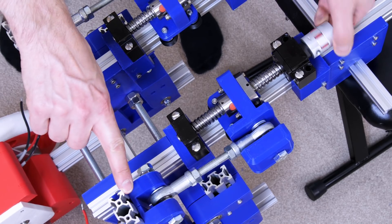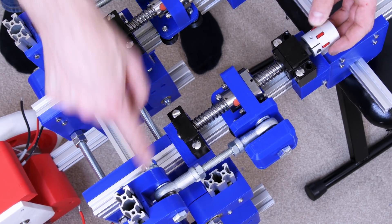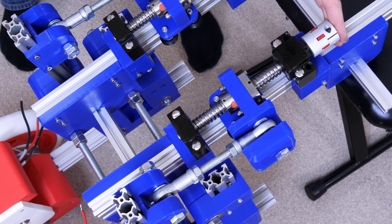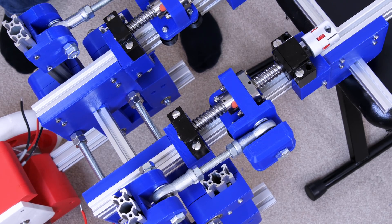I fitted the linkages — two 10mm rose joints with 10mm studding and nuts to lock them in place. Now as the ball screw turns, that moves the joints quite nicely, and even though the travel is short, the leverage moves the legs quite a long way. We can slide the pivot point in or out to adjust leverage. I've got couplers here for 10mm to 10mm, so we just need to fit a pair of brushless motors on the other end and we should be good to go.